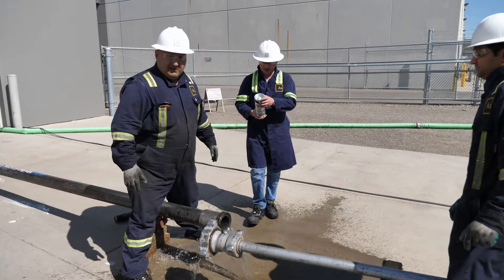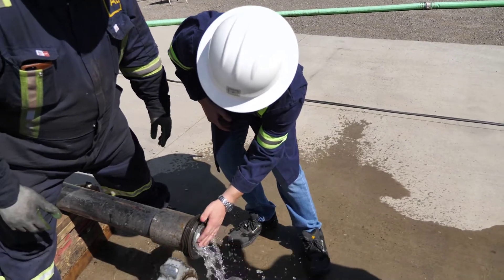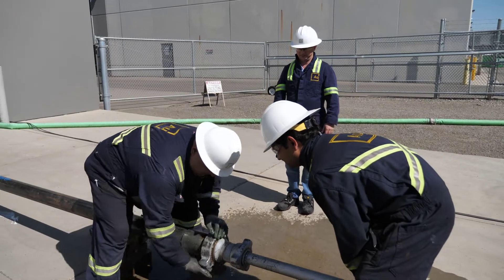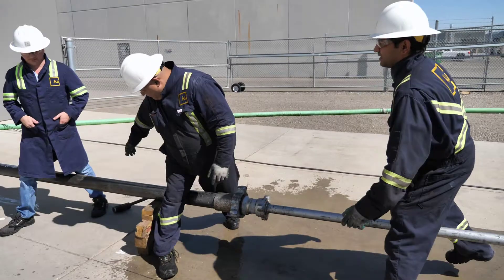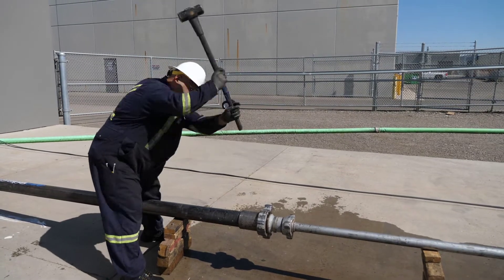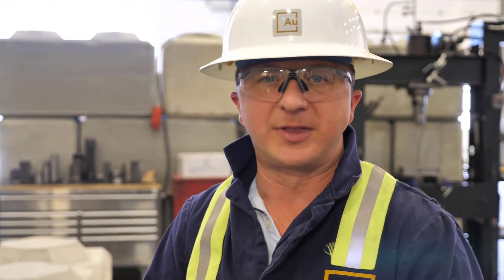The dart is unidirectional — the ball section is going to be up-hole and the nose is going to be down-hole. We'll load it inside the jig. The dart's been loaded in the fixture and we're about to begin pumping. It's going to pass through the remaining sleeves and land in our 1001st sleeve in our simulated weld work.